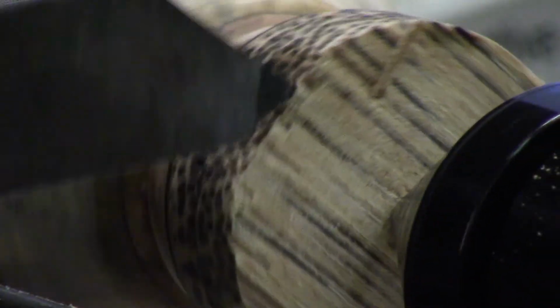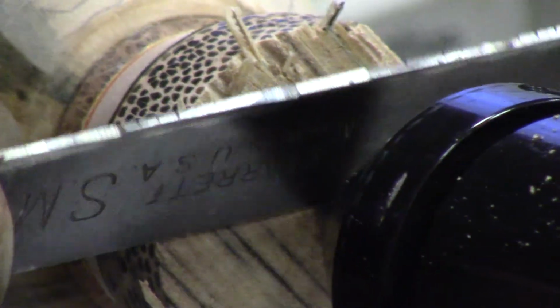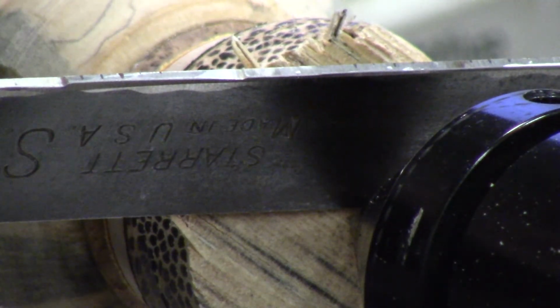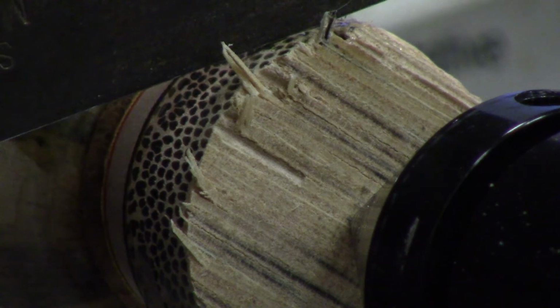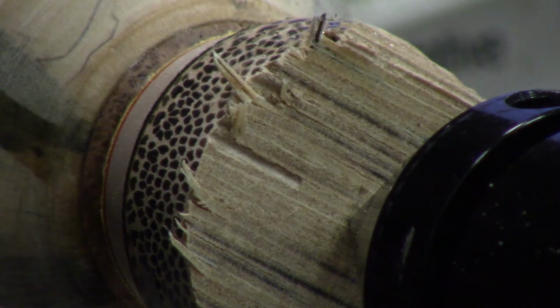Now, the top half of this palm, the fibers are little, it's almost all white on the end. So what I would usually do is I would flatten this side out completely. That way when I cut it off, I know I got one side that's already flat. Because if I cut it off too thin, it's hard to get it on a belt sander. And if I already drew it up here, I would do that. I'm not going to do that on this one.